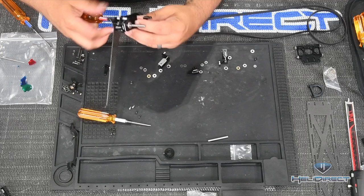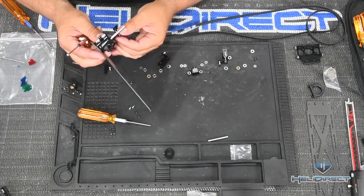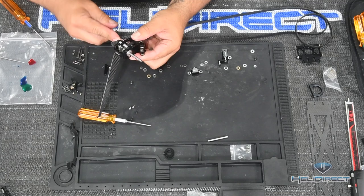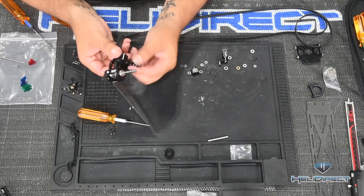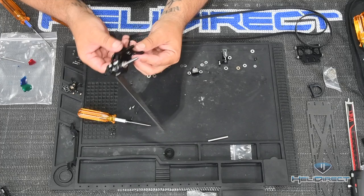You can see, and before you tighten this all the way, make sure that it's sitting within that little square cutout and it's not crooked, because if it's crooked, you're going to mangle it. Alright, so now it's there. I'm going to go ahead and get that nice and snug. I don't want any play in that whatsoever. So now our tail pitch lever is good.